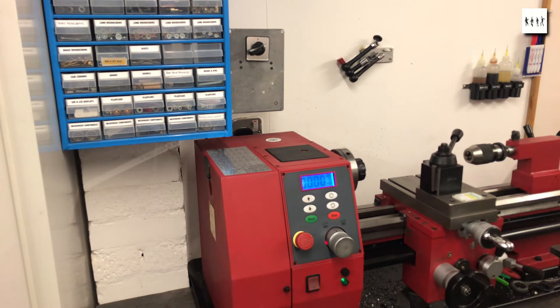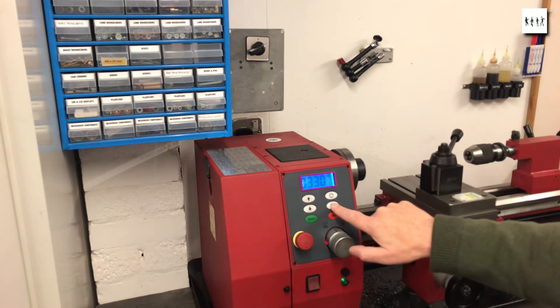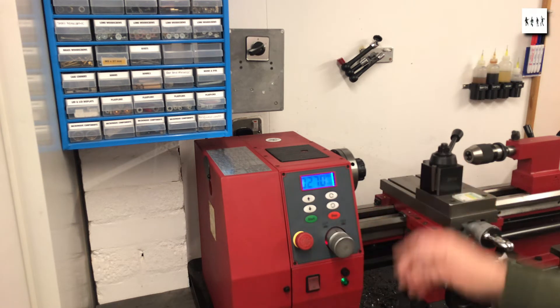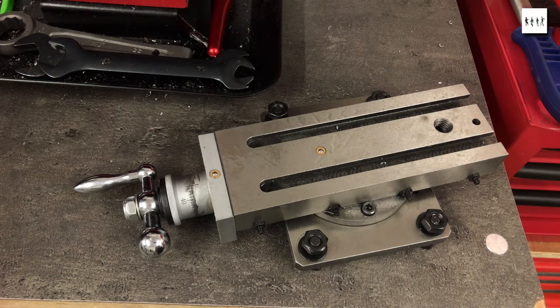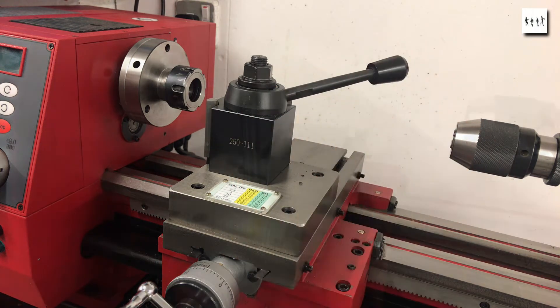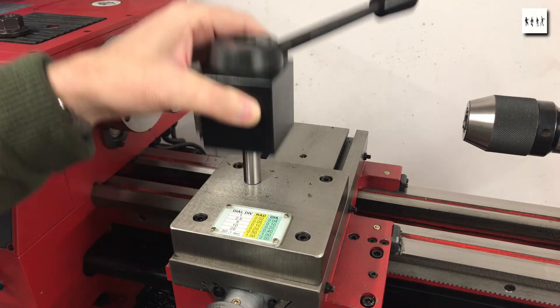For the sake of interest this is the noise made by the gearbox. Despite this lathe being considerably more robust than my previous small lathe, rigidity is still a problem and the supplied compound slide does nothing to help that situation. So I made a solid tool post holder from a piece of conveniently ground both sides cast iron — just drilled a few holes in it and made some t-nuts, then it's just a case of mounting the quick release tool post on it.